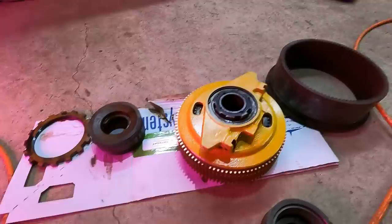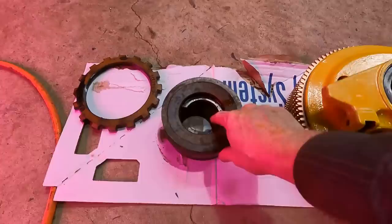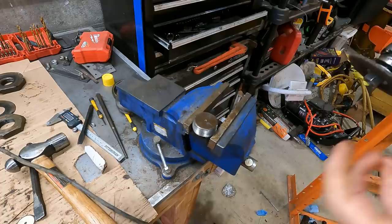The other steering clutch is fully rebuilt and ready to go. I was replacing the seal — this is the thing that holds the cup for the bearing — and I was just tapping the seal out and this just exploded. I wasn't hitting it hard so I think it was kind of damaged. I did get another one, I think it was 90 bucks. Now I get to work on these drain plugs — I got both drain plugs and the transmission plug, and I've verified on all three that there's enough space inside so they're not going to hit anything.